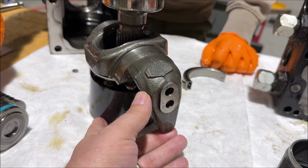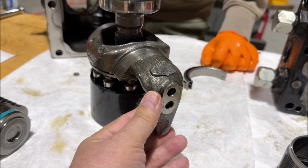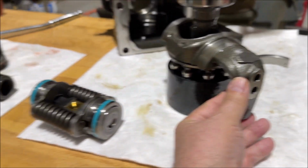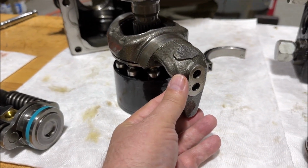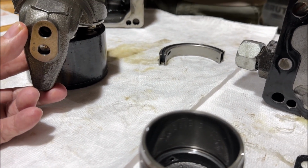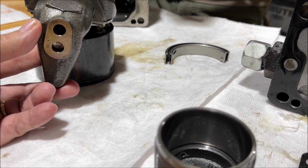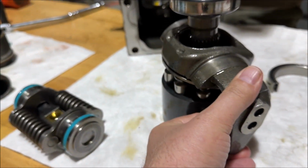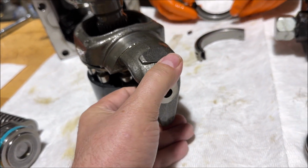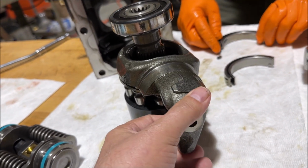Now, if you twist it, if you put it right in the middle, as it spins, the pistons aren't going up or down. I don't know if you can demonstrate that or not. And if you go like this, then the pistons are fully depressed on the backside when it's spinning around, and they're pumping all the oil out the other port. So this is the swash plate. I don't think going this way, it's kind of restricted. It can't move this way, right? No. So it only moves this way and this way, okay?